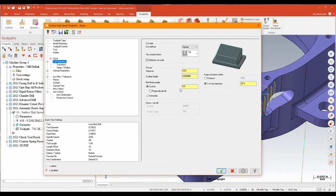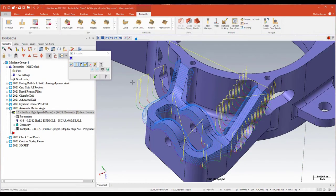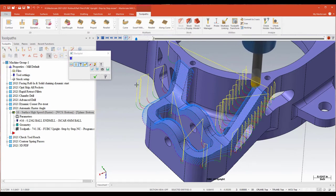That's a great feature, but if you're dealing with something where you're not sure what angle to use, you usually have to spend a fair amount of time in Analyze or drawing some geometry to figure out exactly what angle you're looking for. The current toolpath isn't bad for a raster, but it's not as efficient as it could be because I'm not really attacking lengthwise along those features — I'm hitting them a little more diagonally than I'd like.